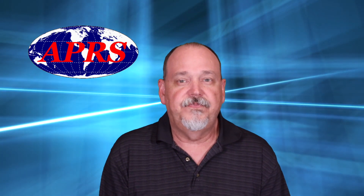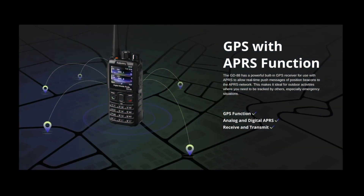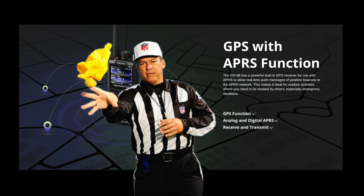Now let's talk about APRS, or Automated Packet Reporting System. Many radios today support APRS transmit or beaconing, but few support APRS receive. The 878 fully supports both analog and digital transmit and receive. The Radiodity website claims the GD88 supports APRS receive, and it does receive digital APRS just fine. However, from what I've tried and read online, analog APRS receive doesn't currently seem to be working — if that remains unfixed, I'd have to throw the deception flag on their website.